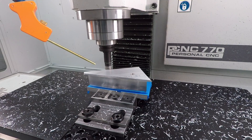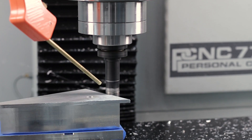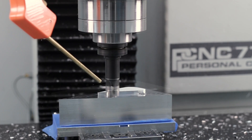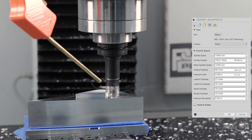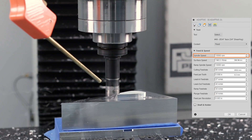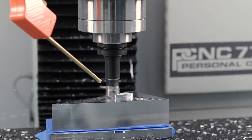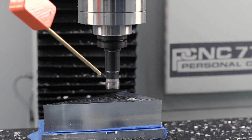We're walking around the outside of this part first with the shear hog. You really don't want to take a tool like the Superfly and have it end up tearing material off because that material overhangs and is unsupported. Same recipe as before — 10k RPMs at 80 inches per minute. The pins gave us really good locating, but they also increased the stability and work-holding power of the super glue.